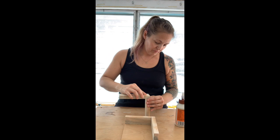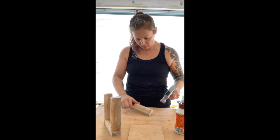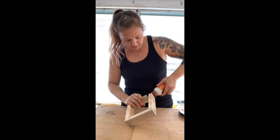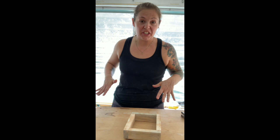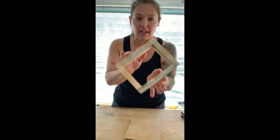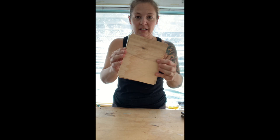In order to put all of these together, I actually start the nails in the sides on the ends before I glue, and then I just nail them in. So that's what I'm doing here. I do all four sides and put a little bit of glue in between each of those joints. It is like 90 degrees in this room, so I'm rolling with some sweat, but I've got my four sides all nailed together. There is wood glue in between each of the joints, and when I lay it down on this panel it lines up pretty well, so I'm excited about that.